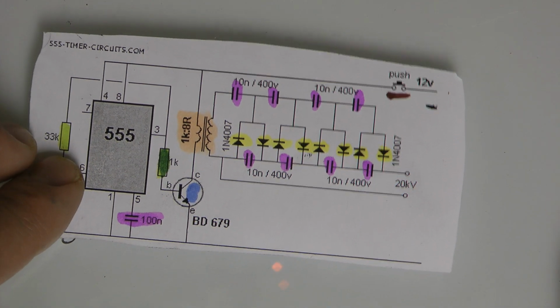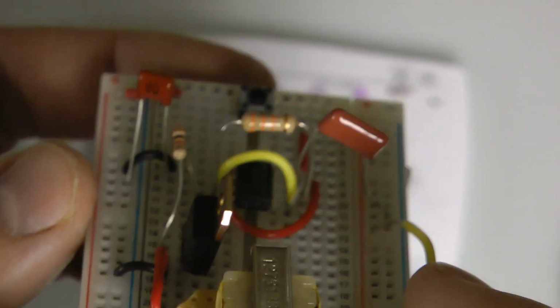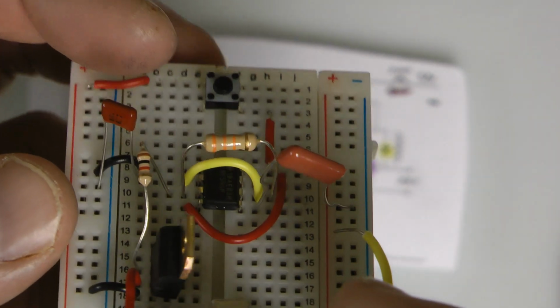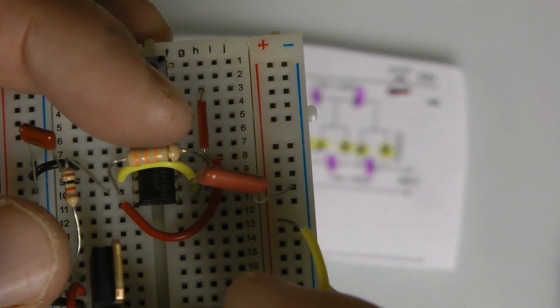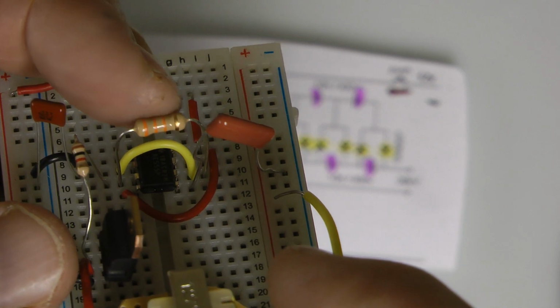Resistor values are very easy. They're indicated with a stripe on them. So you can see orange, orange, orange with a gold band. The gold band dictates the wattage or tolerance level. Ignore the gold band and just look for the first 3.